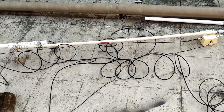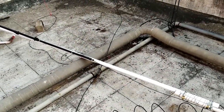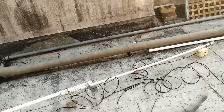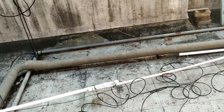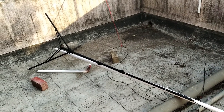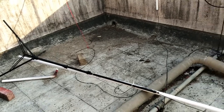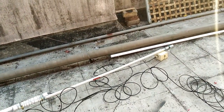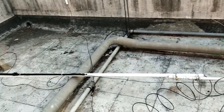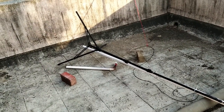I tested this last evening and the SWR was around 2.3 to 2.4, but right now the length of each dipole leg is approximately a quarter of a meter higher than it's supposed to be, so I am getting the resonant point at around 13.5 to 13.7 MHz.